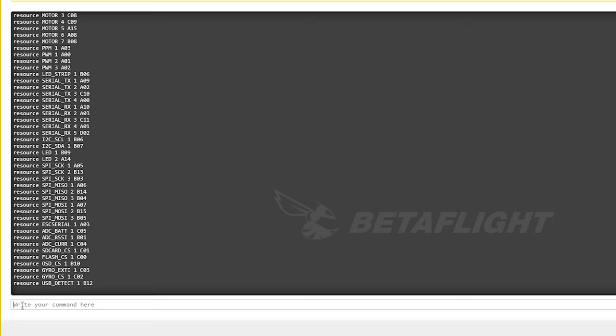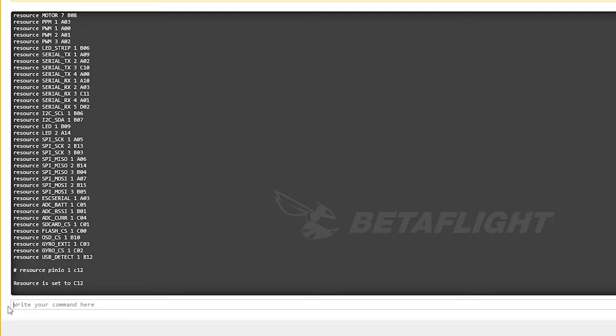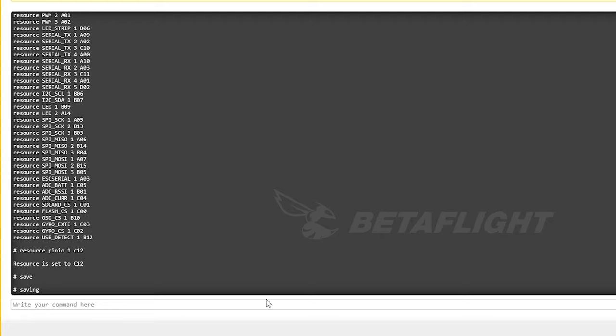So what we're going to do next, we're going back to the command line. We're going to type in resource PINIO. I might be saying that wrong, but oh well. Space 1. Space whatever your 3-digit code was that you had. Mine was C12. We're gonna hit enter. Resource is set to C12. We're gonna go ahead and do save again, and I will see you back here in a minute.